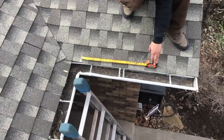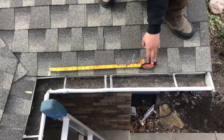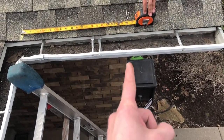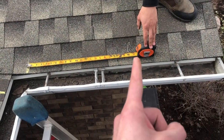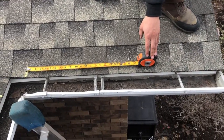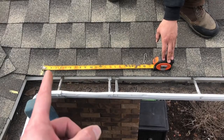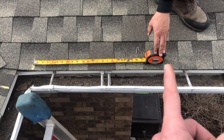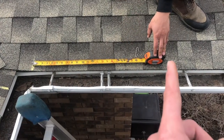On this last section of the roof, we have three and a half feet, but as you notice, we have a wall right there. A lot of people make the mistake of thinking that on this outside gable you need heat cable going up it, whereas you really don't, because it's a cold roof all the way to the peak. So technically, we really only need to add heat to the wall barrier point. We're going to take it just past the wall barrier and go from our mark 20 inches out.